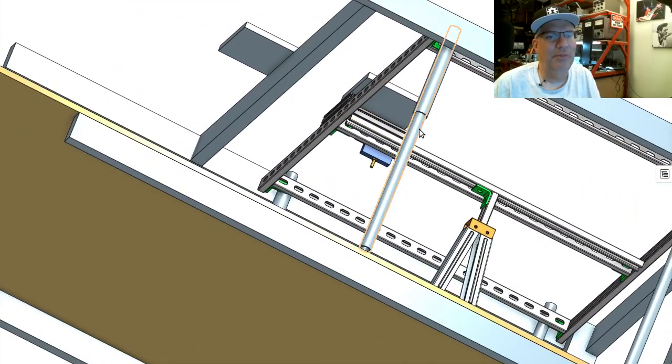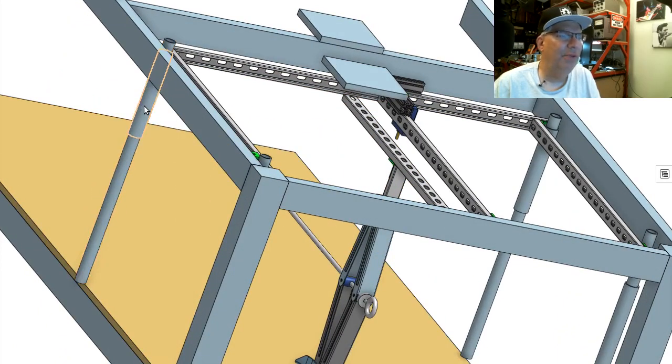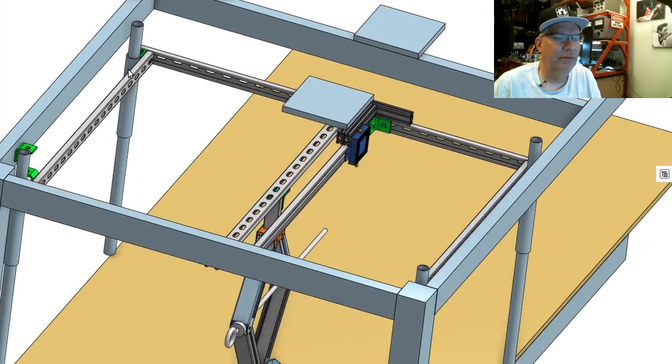From last time: I have a one-inch PVC pipe and a one-and-a-quarter-inch pipe. Of the pairings available at Home Depot, only these two sizes will slide inside each other. Because it's PVC, it has a low coefficient of friction so it slides really well. I'm going to have this registered on all four corners — the smaller one-inch pipe is my slide shaft, attached to the workbench, and the platform moves up and down with the scissor lift.